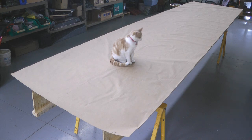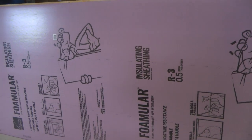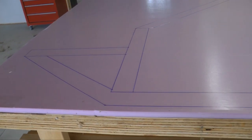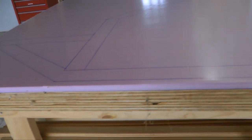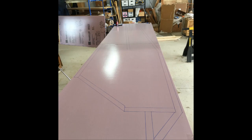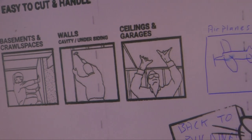It also allows us to remove the paper and unroll it so we can use the table for other things. Another option instead of paper is to draw on high-density foam board used in construction — it comes in 4 by 8 sheets of various thicknesses. You would take two of these sheets and lay them on top of your table, joined together in the middle to make a continuous 16-foot span. This could also be laid on the floor if you didn't have or want a 16-foot workbench but had a nice flat floor. Just another idea.